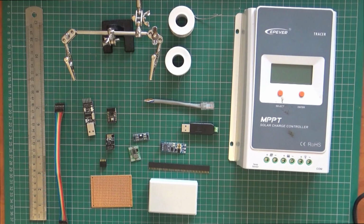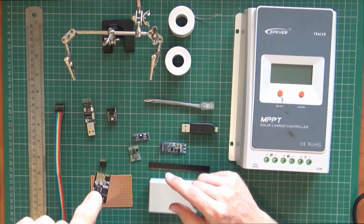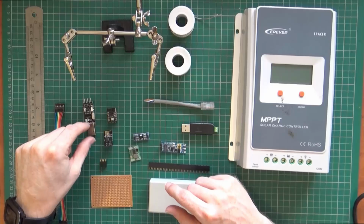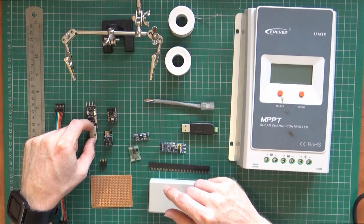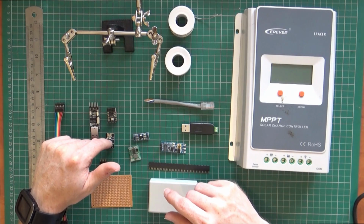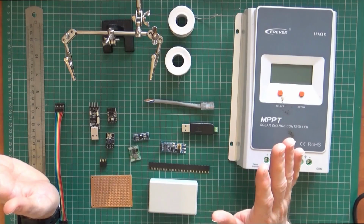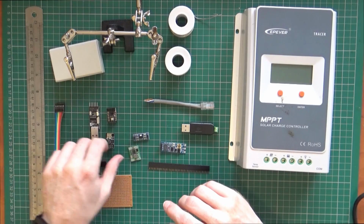Okay guys, I hope that was helpful. It's relatively straightforward. The most complicated thing I find is trying to reliably get these to flash. Even using a proper tool, I find they're quite finicky. And also beware, I have another tool which is an FTDI based board, and that refuses to flash the 8266s. I don't know why it is. It gets so far through and it's reproducible. It's something like 86%, and it just kills itself. It's silly. But once you've got that flashed, that's ready.